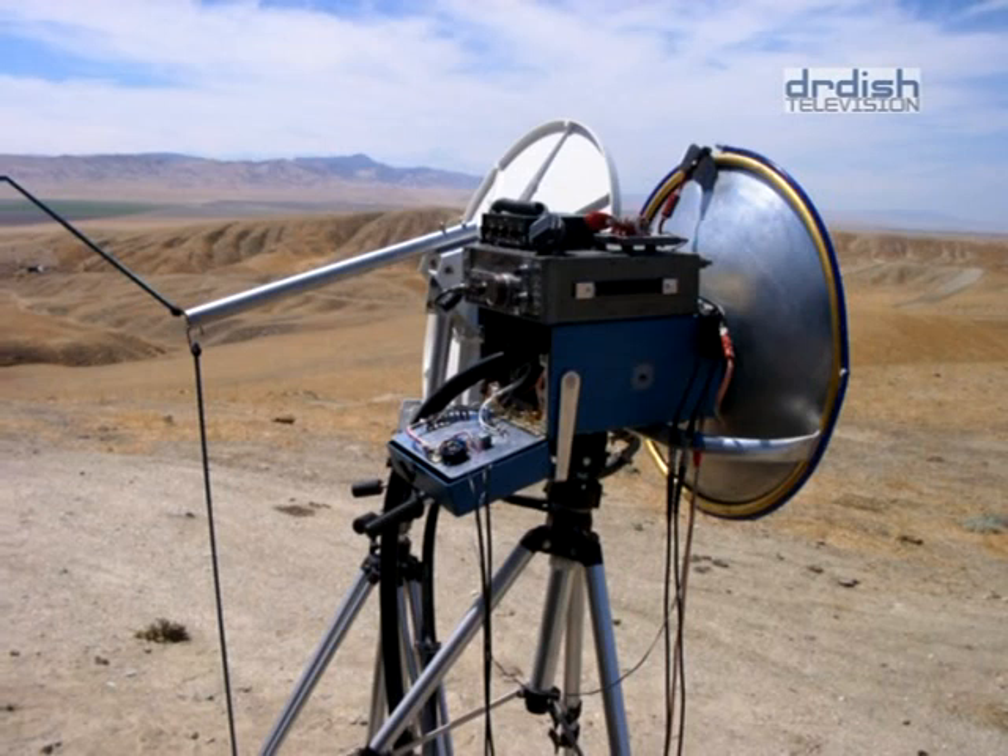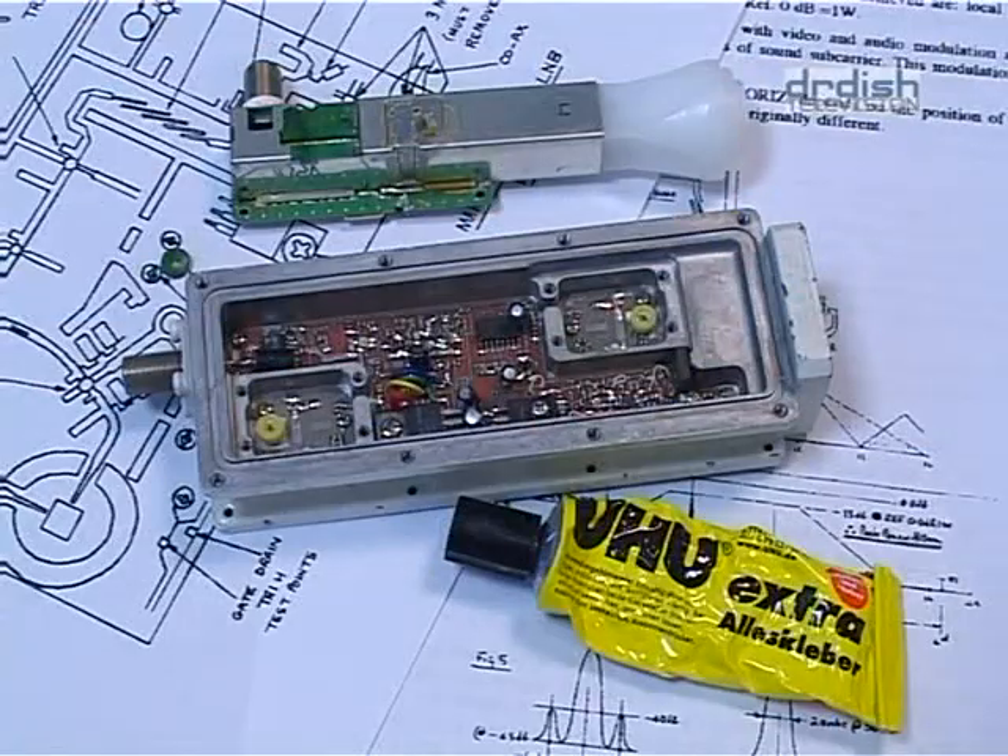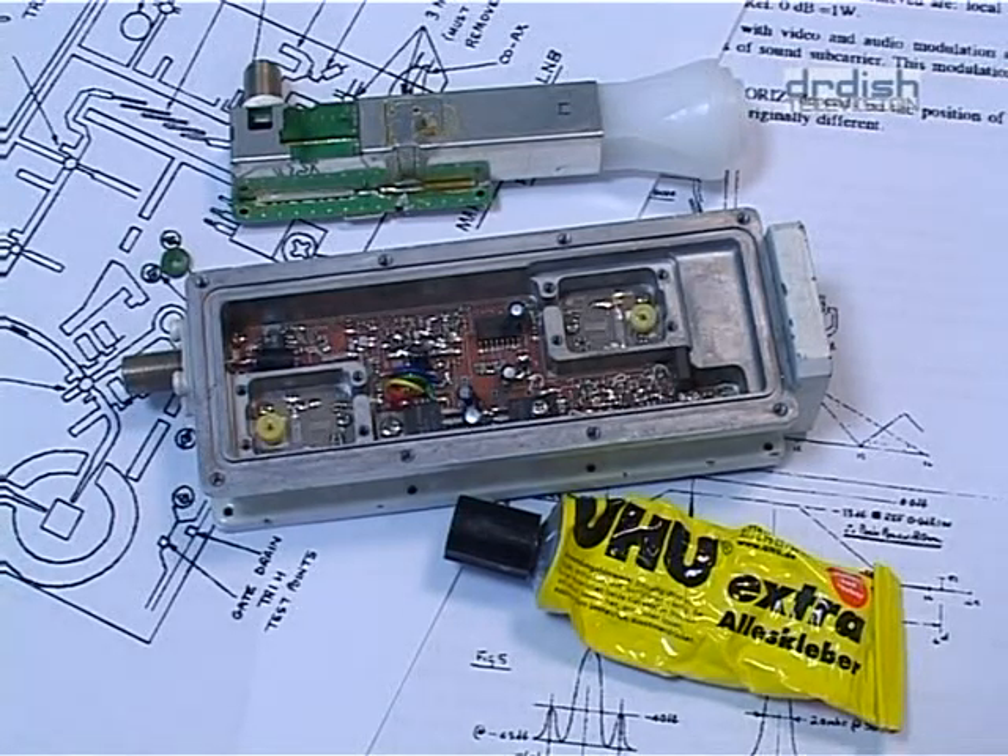In order to lower the local oscillator frequency to 9 GHz for amateur needs, we only need, as mentioned at the beginning, not more than an old suitable LNB, a flat trapeze capacitor, some crazy glue, and, for checking the frequency, an old analog satellite receiver. In terms of LNBs, you should go with the blue caps or even older. You would have to nearly destroy today's modern and cheap LNBs to get to their guts.